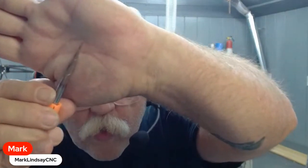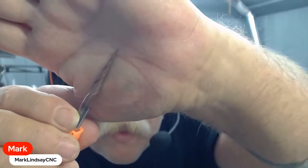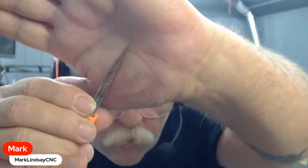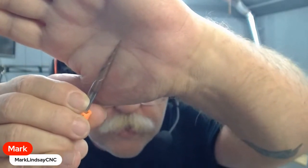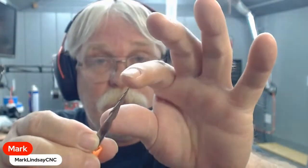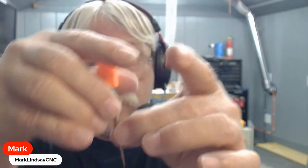And that's almost a needle point when you look at that puppy. I mean, I misspoke. This is a 1/4 millimeter tip radius. So the tip diameter is 1/2 millimeter. And that is almost needle sharp. But it also makes for long machine times, depending upon the size of the project, of course. And that is an upcut.